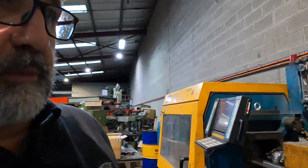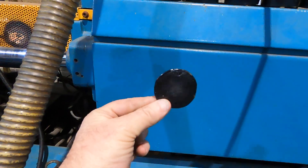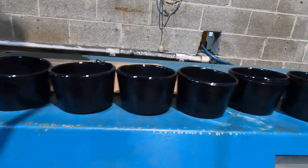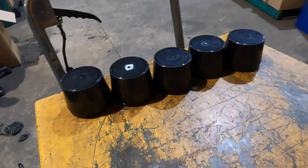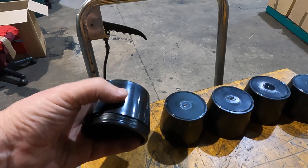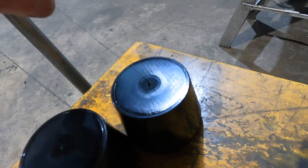Okay, we've been beavering away here, slowly coming up to speed. We started off with that first shot there — as you can see we're slowly just coming up to what we need. Over here we have five shots that we're now going to leave overnight and check the sizes of in the morning. We haven't got the right finish on the side yet — this has got to be a rough finish as per the originals. We're a little bit stringy on the top there — that's more screw positioning and temperature that we have to muck around with. But what I'm going to do now is swap over the slides and make some G5 ones.